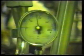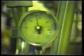The homogeniser pumps milk through a narrow orifice at 2,500 pounds per square inch pressure. The shear forces generated break up the fat evenly so homogenised milk does not show a cream line.